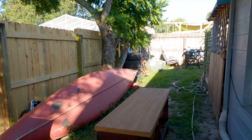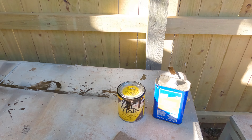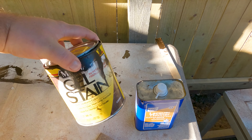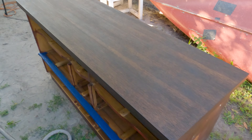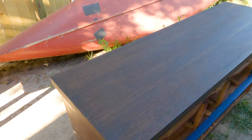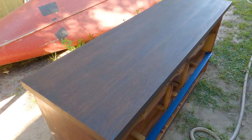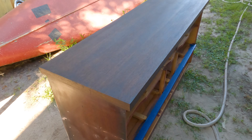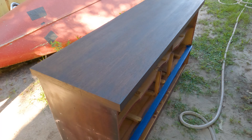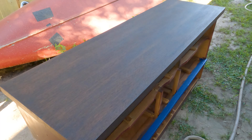It's day two. We just finished sanding everything down again. Aga is going to apply the stain — we've thinned it out using lacquer thinner so it's a bit more runny, and hopefully it's going to be less blotchy. We just finished re-staining and it was a success! We thinned out the gel stain with lacquer thinner, and that helped a lot. Also it's just past 8 a.m. so it's not that hot, and those two things really helped. We're just going to wait until it dries and then mask it off and paint.